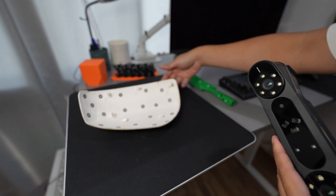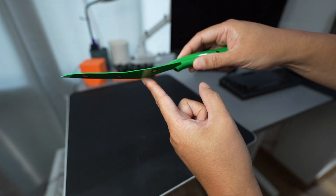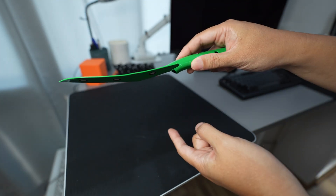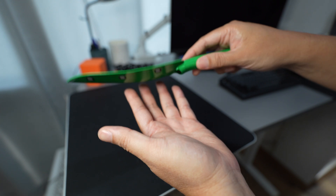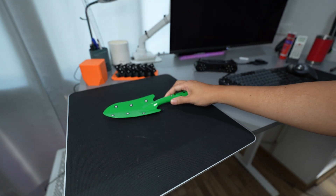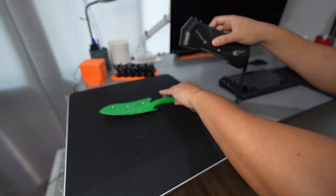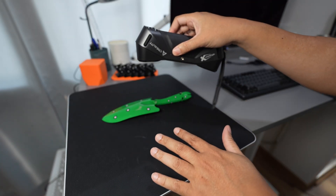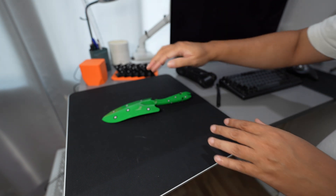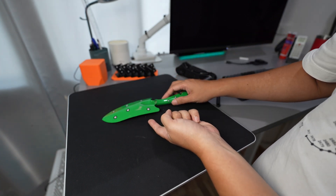If I want to do the same with the trough, it will only see the markers on one side but not both, so there is no angle where I can transit from one side to the other because the profile is very shallow. If I place it on the table and scan the top side, then flip it over and scan the bottom side, the chances are I wouldn't be able to merge, because when I scan one side there is no overlap area the scanner can see — it's underneath the part.